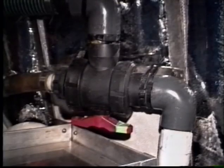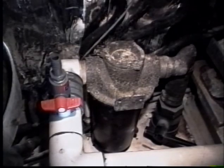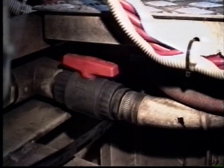This valve is plumbed into the deck drains. There's one on the other side too. It allows us to divert rainwater from the decks into the tanks. We have a single 2-inch seacock, which feeds all the raw water for the boat through a manifold. A 3/4-inch line is teed off with its own valve to supply the two heads.